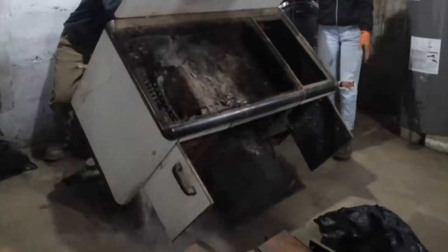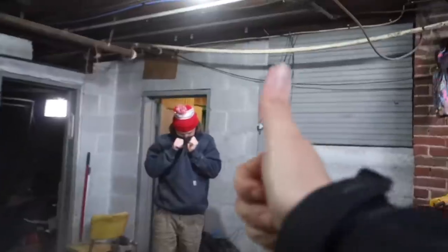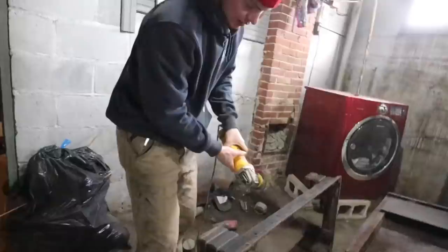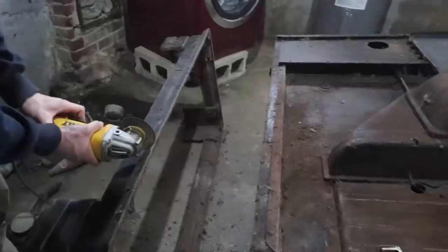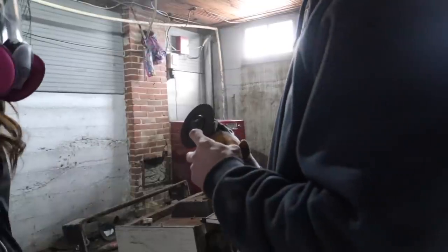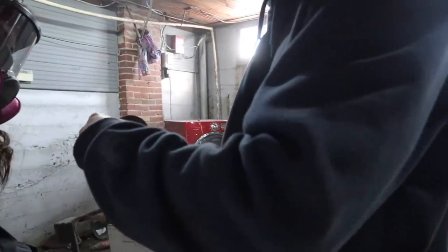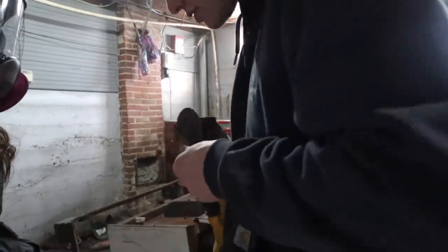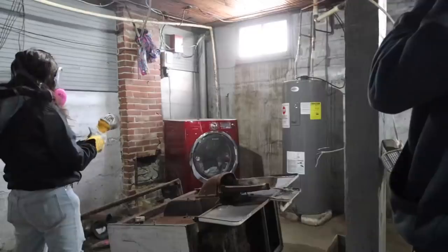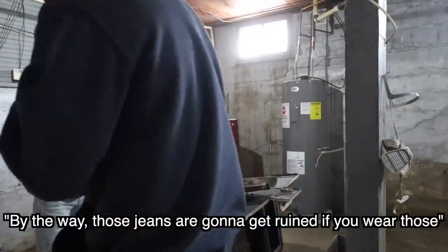Watch out. That works too — cut the base off. Good job, Cole. It's going to shoot sparks. You have to flip that down and then you'll be able to push. Never cut with the top of the blade, only the side. If you get towards the front, there's a higher likelihood of catching. If you cut right on the bottom of the blade, you're going to be fine. When the blade becomes a little nub, you're going to have to get a new one. See that button? Push it, then turn this until you hear it click into a groove. Take your little tool, line it up with the two holes that match like this, then turn yellow-sided up. Take your tool and just get it snug. By the way, those shoes are going to get ruined if you wear them.